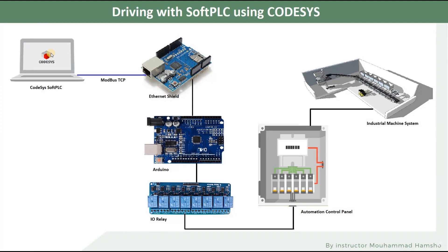However, since the soft PLC is on a computer, you won't be having any input/output pins, so you cannot directly control contactors, relays, and whatsoever. We need a buffer in order to take all of these signals and activate the real hardware. We're going to establish a communication between the soft PLC and the Ethernet shield of the Arduino. The Ethernet shield will communicate with the soft PLC using TCP/IP and what's called a Modbus protocol encapsulated inside that TCP/IP.